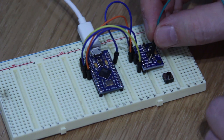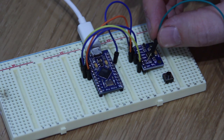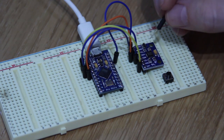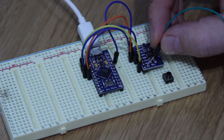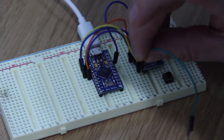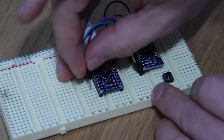The INT pin is optional. But if you don't wire the INT pin, you need to be very careful to ensure that in the software you set the device to polling mode, not interrupt mode. So if you don't wire the INT pin, you must set the EdTracker software to polling. My advice is to wire it — wire the INT pin to pin 7 on the Arduino.